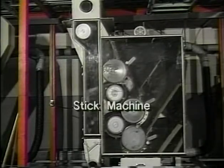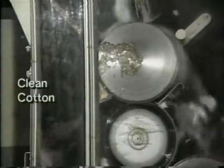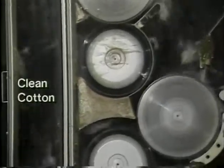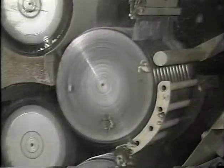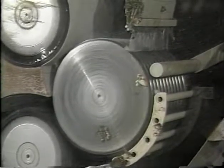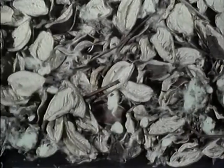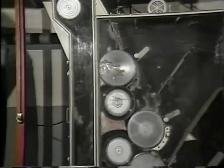The cotton is discharged into the stick machine. It passes over the first cleaning saw where the clean cotton goes directly to the next machine. Burrs and sticks, along with as much as a quarter of the cotton, is slung off over cleaning rods into the reclaimer section. The reclaimer saws and rods are similar to the main cleaning unit, but their adjustment is different to minimize the cotton discarded with the trash. The stick machine is designed to remove burrs and pieces of the cotton plant one to three inches long. Gins which process trashier stripper harvested cotton are usually equipped with at least two stages of stick extractors, and many gins have three stages.